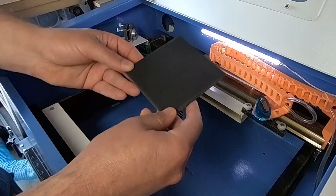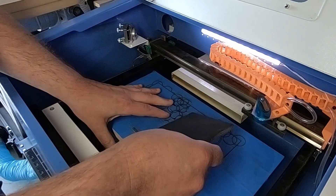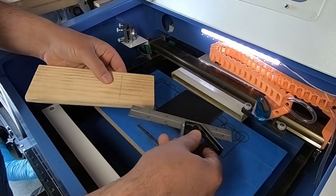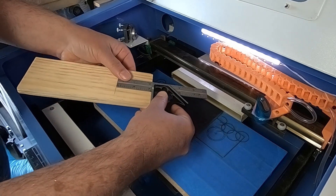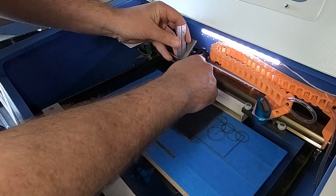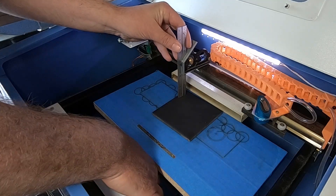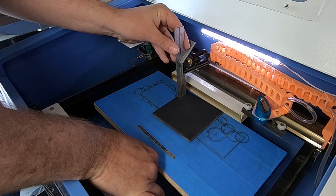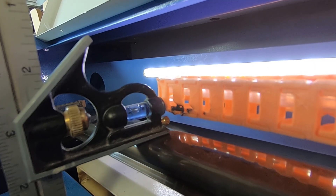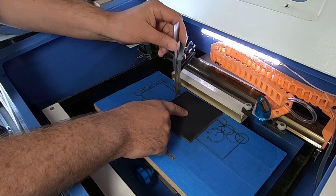Let me show you how that looks. Let's say we want to engrave this black tile — I'll put in my scissor jack (lab jack) and put my material right on top of that. Then I'll bring back my story stick and reset my focus so that it lines up right here. We'll lock this thing down and put it right on top of the bar. You can see by the level that it is not level, so we'll bring this down a little bit by twisting this knob — right about there. Now we know that our material is at the optimal height for our laser.